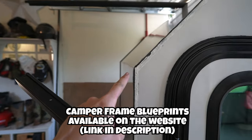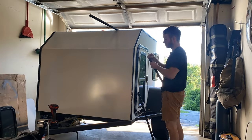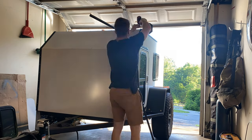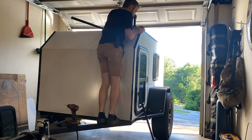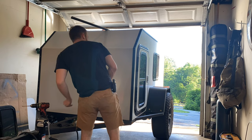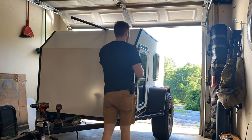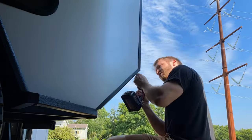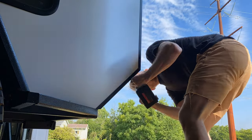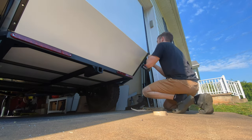We're going to line this up — this piece ends up being about 17 inches, though yours may vary depending on your frame. To secure the trim pieces I'm using three-quarter inch long self-tapping screws, available in bulk at a store like Tractor Supply. There are predetermined holes in the trim so I run around putting a screw in each one. If a piece is cut a little too long before a predetermined hole, I drill a new hole closer to my end so every section has enough clamping force. Any butyl tape squeezed out at the edges I trim off with a razor blade and it peels right away, leaving a nice flush finish.